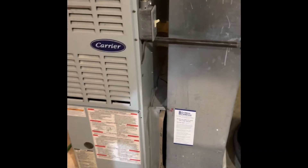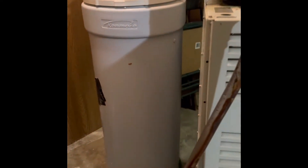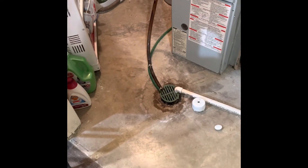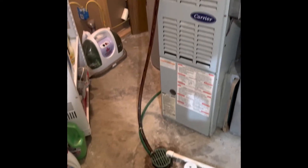We'll do a new one-inch media cabinet in between the return drop and the furnace. Then we're going to have to take up a little bit of space here on the left side of the furnace so we can fit our B-vent, furnace drain lines going down to the floor here in front of the unit. We'll just reconnect all of that or put new vinyl in.